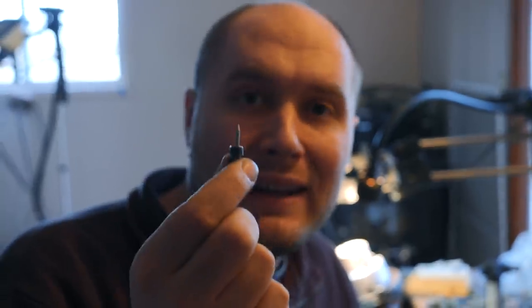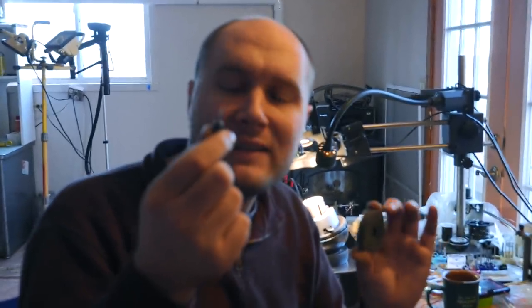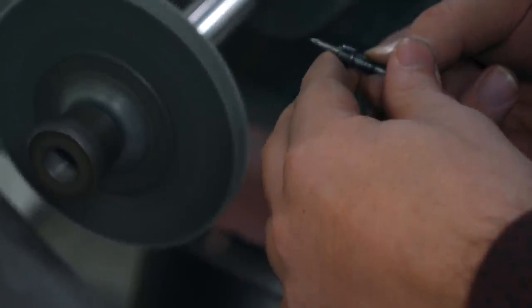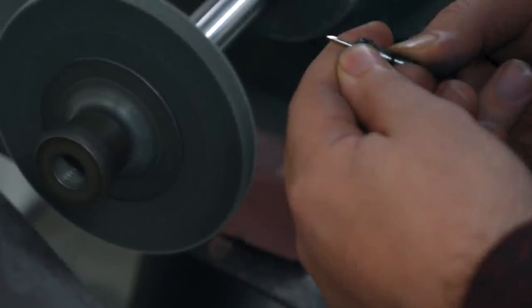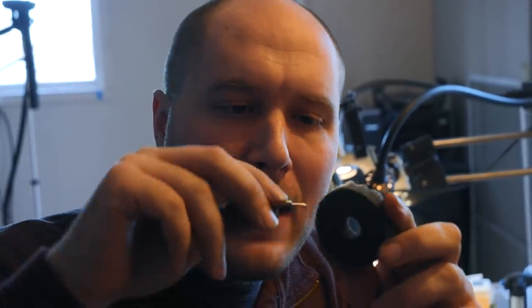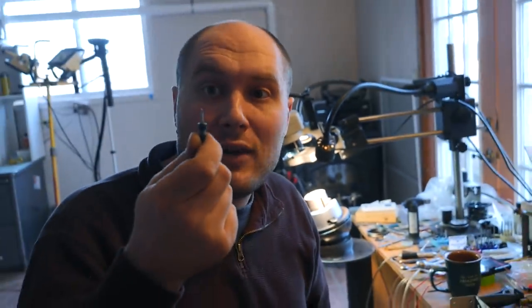Something that makes this carbide cutter much more durable is to sharpen it on the diamond sharpening stuff, and then I take it out on the Scotch-Brite wheel and lightly put a little bit of a convex edge all around the little spade cutter. And that helps the carbide not to chip and just break, because if you leave it sharp, the carbide will break off like almost immediately. But if you round it with that Scotch-Brite, it'll make it really tough and last a long time.